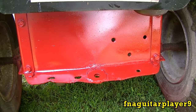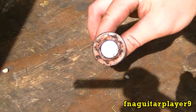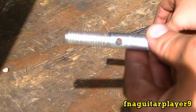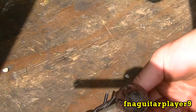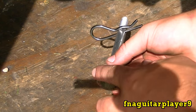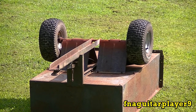Here's the bolt — you can see I welded it on, just tacked it. I'm gonna get ready to prime that and drill a hole for a hitch clip, which will be better than using a nut. I'm gonna paint the top of this to keep it from rusting.